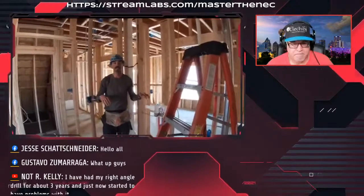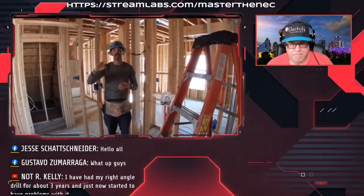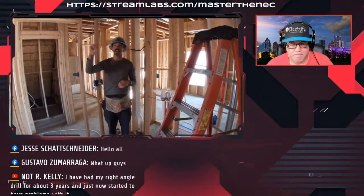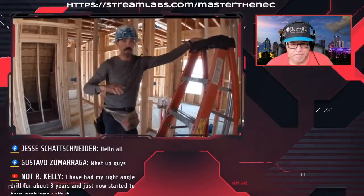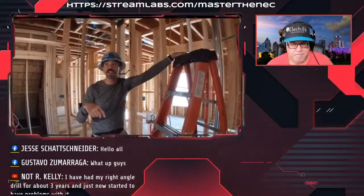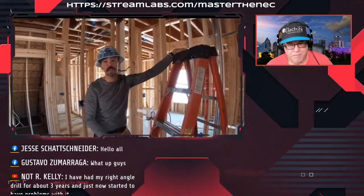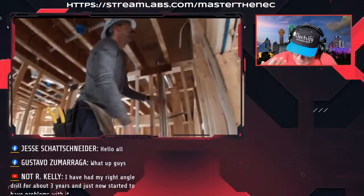Okay, on this circuit, I have the garage, the laundry, the foyer, the dining light, and the kitchen lights all on one circuit. I know it sounds like a lot, but when we go to trim this house out, most of the lights are going to be LED, and they don't take much power. So I'll make a comment on that.